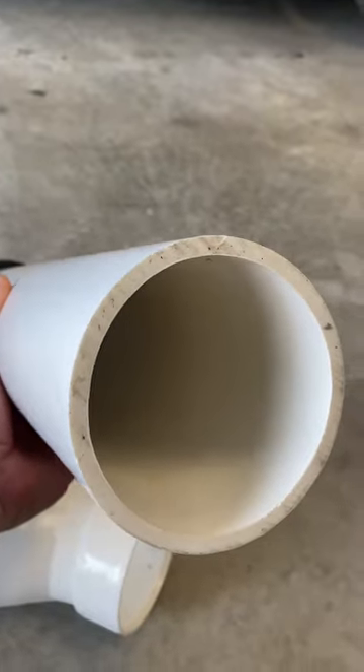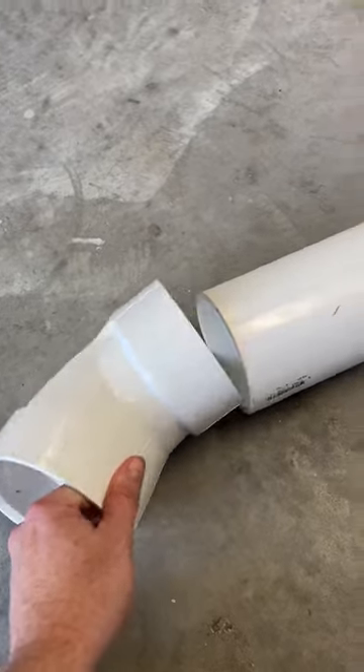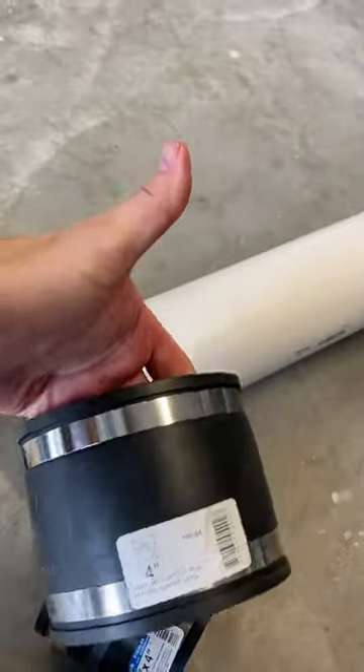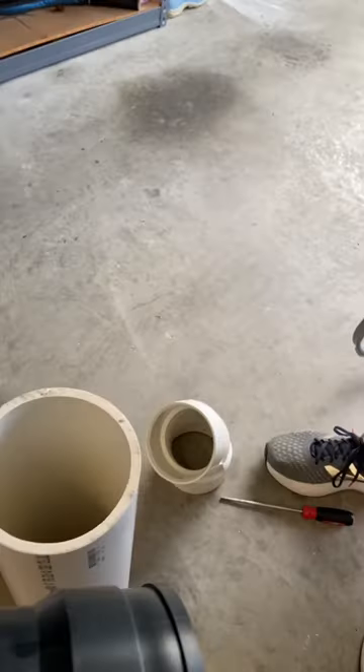You need a short section of four-inch PVC — see how thick that pipe wall is, much bigger than the thin sewer pipe wall. A 45-degree elbow like the broken one is available, but I wouldn't recommend the thin-wall version because of how easily they break. The full-thickness PVC is a lot stronger. The short piece of four-inch pipe is about $25. For the connectors at each end you need a tapered boot — this is called a four-by-four — which transitions the bigger section to the smaller section. That's different from a standard four-inch coupling which has no transition. Make sure when you buy the boots that they have bands on both sides, particularly at Lowe's, because people steal the bands and you'll get home without what you need.